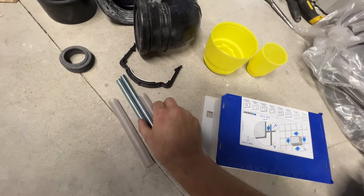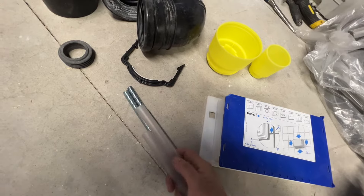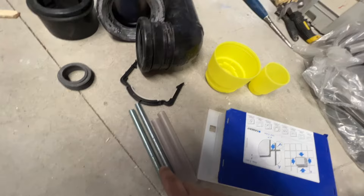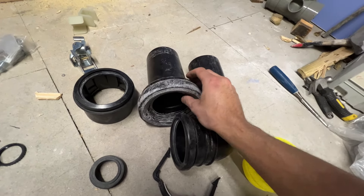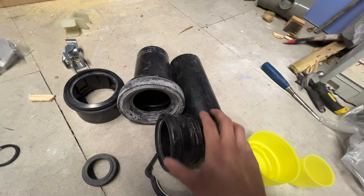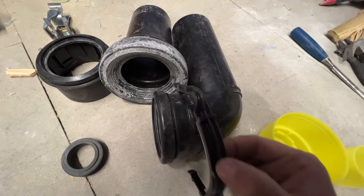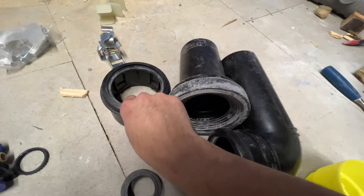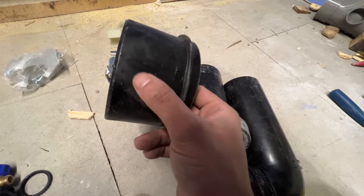There's a tileable template guide for the flush button so you don't have a big gap at the end. You've got threaded rods which take the weight of the pan and they come with covers that you slide over — that stops tile adhesive going into the threads. There's a pan connector which goes on at the end of the job, like a 90mm pan connector, and a 90mm bend with ridges where this clamp fits into the frame.